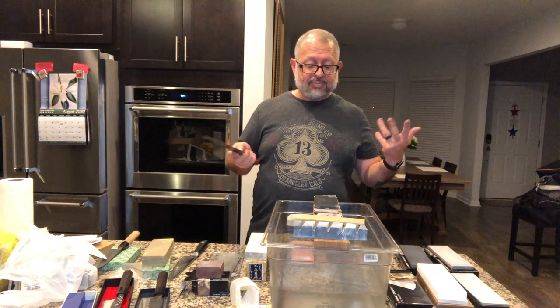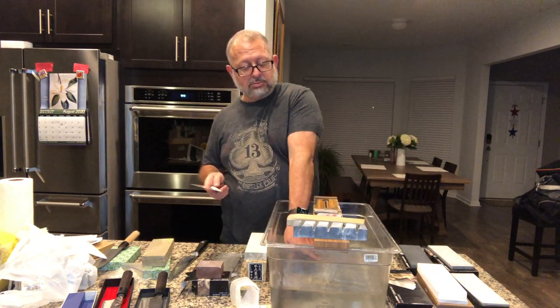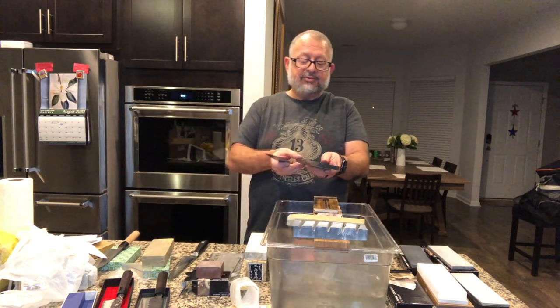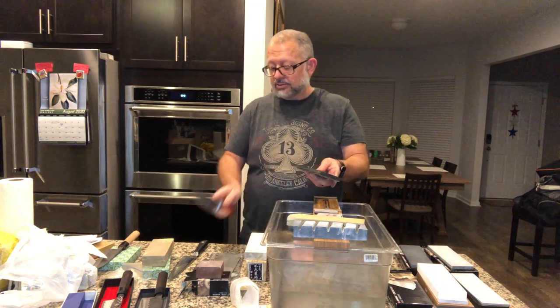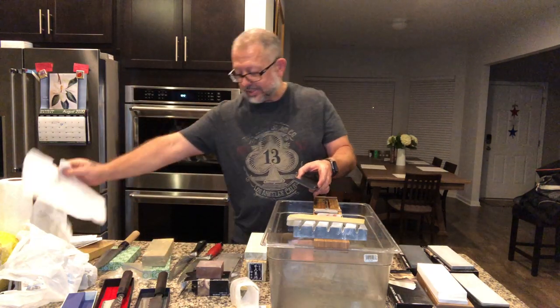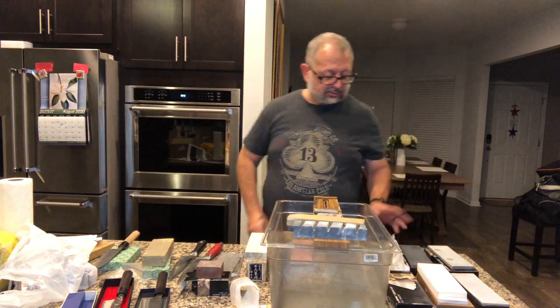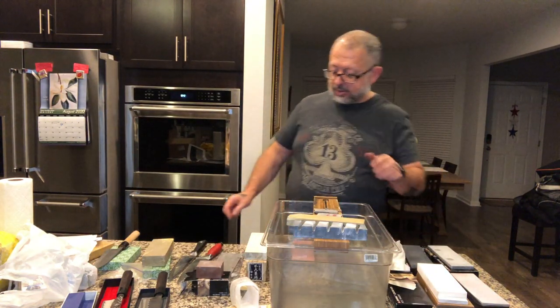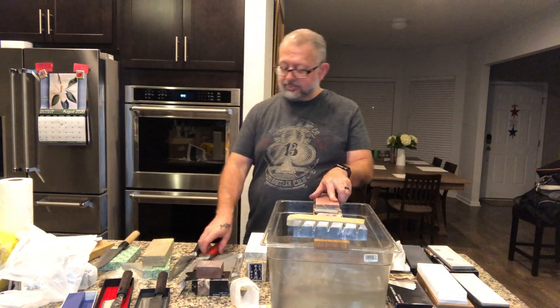All right, so let's see if we can get this knife better. We're going to move the 1,000. I am not leaving it in the water. I'm just getting all the mud off of it so it doesn't harden and create a problem for later. We have paper towels handy, so let's use them. And we'll let that sit there. All right, so should I go to the 3,000?